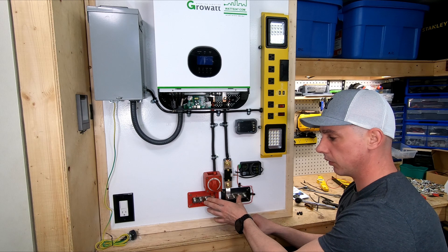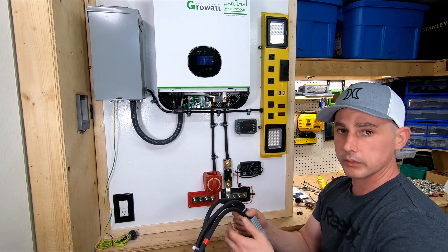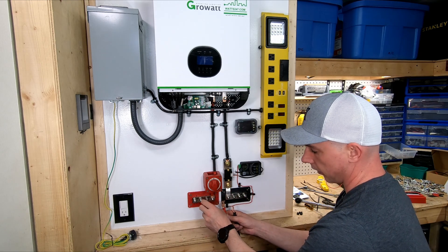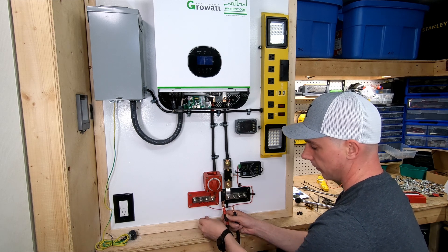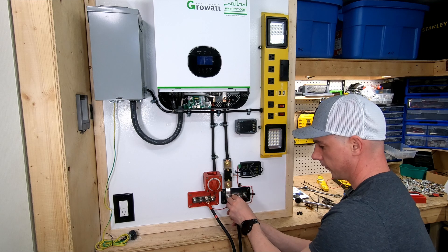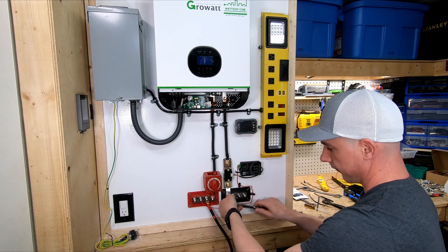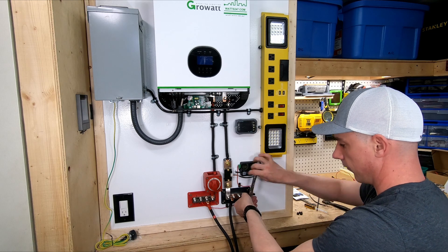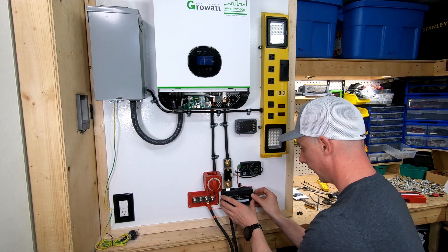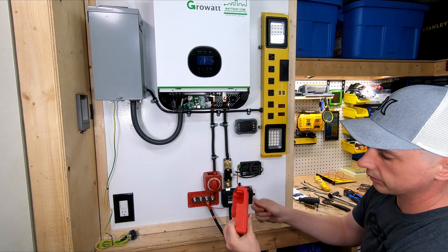Next I'm going to hook up my battery cable, which is going to have an Anderson connector on the end. This is going to be running to my battery toolbox build that you guys have watched before. I just have my positives and negatives, and I'm going to run this to the bus bar in the slot that's right next to the cable going out to the battery. Now I can tighten everything up. These bus bar covers have little knockouts — I've already knocked this one out front and back and they just get pulled right out.